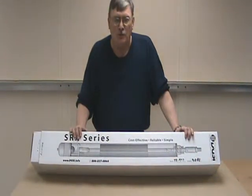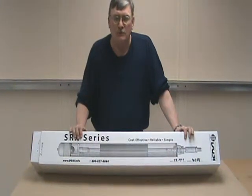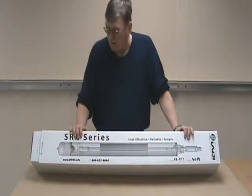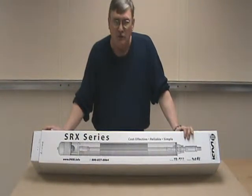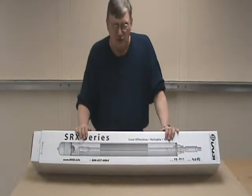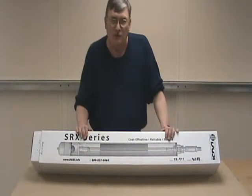The reason why the TR-980 is shorter is to get the maximum drawdown in your recovery well. This pump line can operate in two-inch and larger ID wells. What we're going to be showing today is how to unpack your pump and do a pre-installation check to make sure the pump hasn't been damaged in shipping. The same checks apply if you have a pump malfunction during operation.